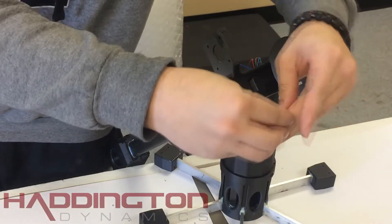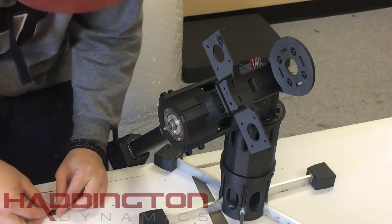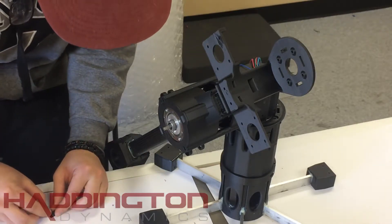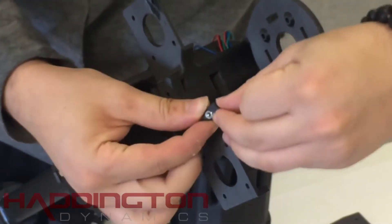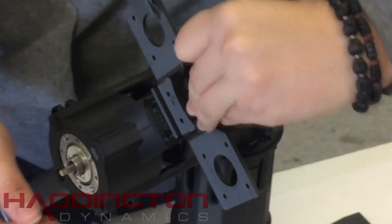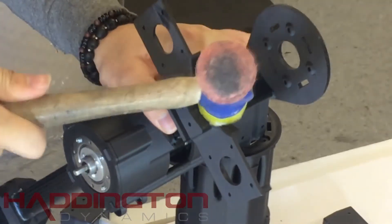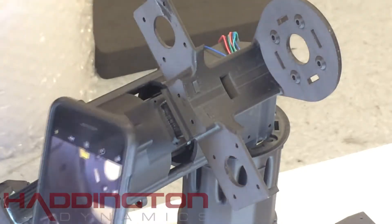Finally, we can start mounting the external gear onto Dexter. To begin, take both unique external gear nut holders and press fit an M3 nut into each. You should notice each one has its own curve on it. Press the nut holders into the top of the external gear mount, nut side up. Their curvature will fit seamlessly with the external gear mount once pressed in. Once they are pressed in, check the holes in front of them to make sure the nuts are lined up.